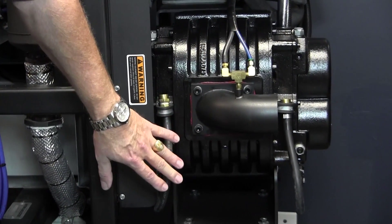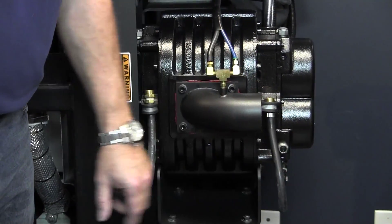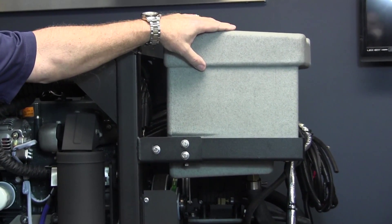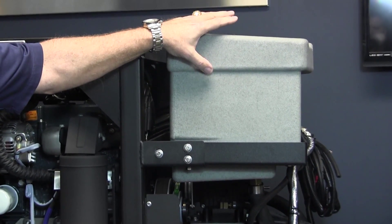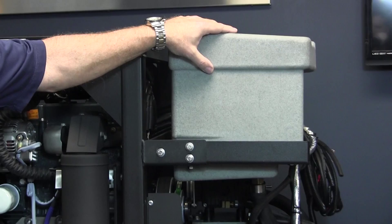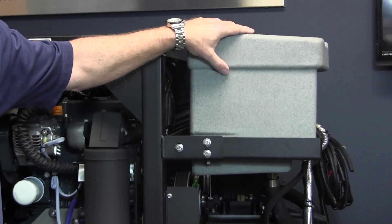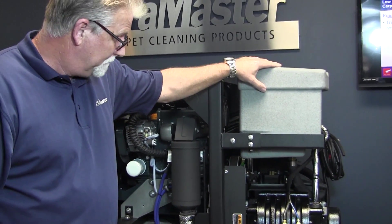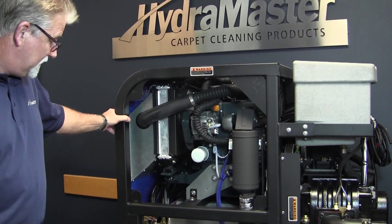Just to take a brief look at what we've got here: these hoses are our drain hoses — we'll get into that on the maintenance side. We have an eight-gallon water box here, very critical. When it's in the pump mode, it's critical that water be supplied. Sometimes we'll get calls where somebody has accidentally turned off the water pump, this is empty, and therefore the machine isn't going to run. So let's move around to the right-hand side of the machine.